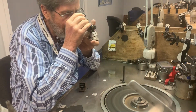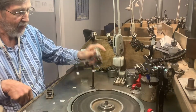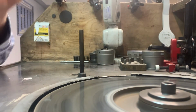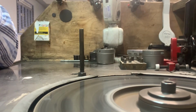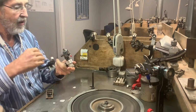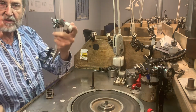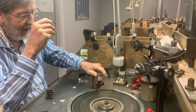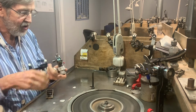Now with diamonds, we have to have the correct running direction. It is not like other gemstones. Because I do not have the rough crystal set up in here, we have no idea of what the crystal structure is like, and we need to kind of hunt around to find out where the facets are going to be cut. Okay, we've got this one, and so we have it on the right angle. So what we have here is a ratchet over here, and that gives you your radial position for the facet. So each facet has got an angle, and each facet has a specific radial position, which is also called the index at which the facet needs to be cut. So yeah, let's go ahead and just do a few of these.